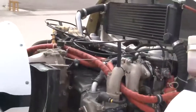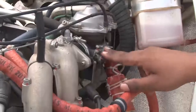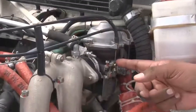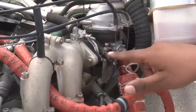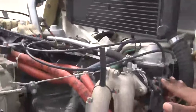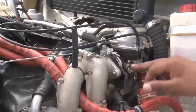Check throttle, choke, and oil pump wires for no mechanical damage and smooth, unobstructed movement. These are the throttle wires and the choke wires — they are proper, no damage, they are properly and securely attached. You can see the movement — we are moving the throttle from inside the cabin. There is proper movement. The throttle is touching against the stops on both sides. Similarly, we check the other carburetor — there are two carburetors in this Rotax 912 engine, one on the left side and one on the right side. The throttle cable and the choke cable are properly, securely attached with no damage. The throttle is touching both stops.